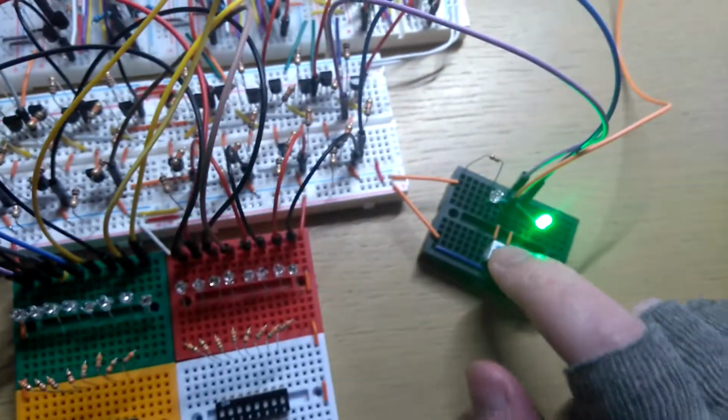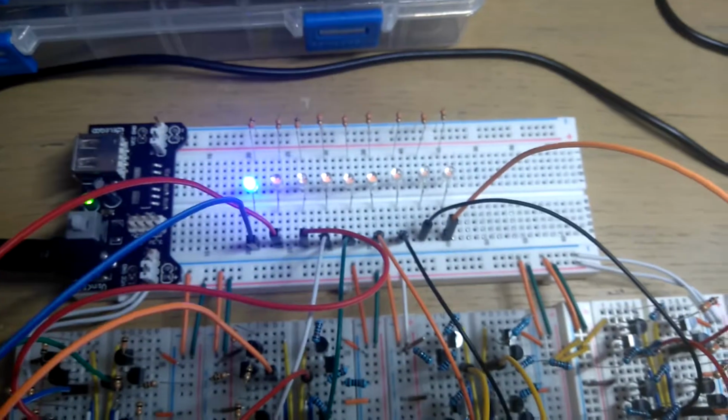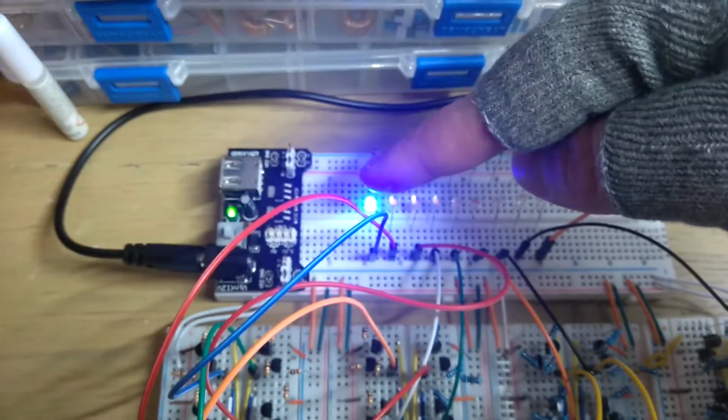So now let's try some subtraction. One thing I'll notice here, when you switch to subtraction, that final carry out gets set to 1. That's because these are all actually inverted and then 1 is added to it.